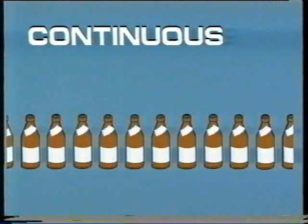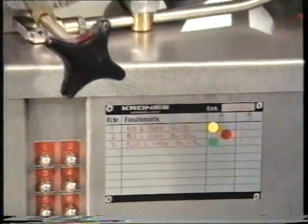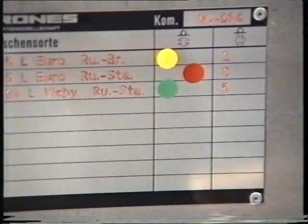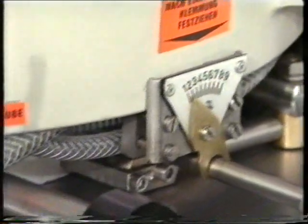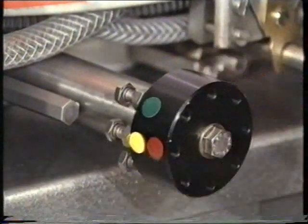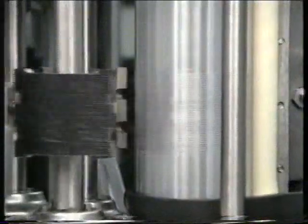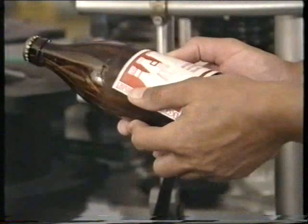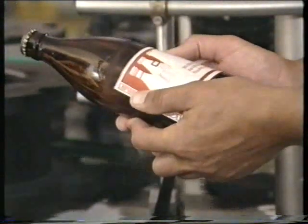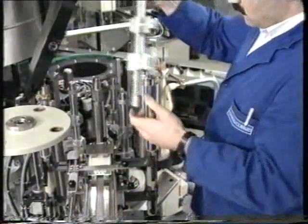Now to continuously slanted or shifted labels. The position of the aggregate with respect to the bottle plays an important role. Therefore, for each bottle, the cross slide must be positioned at the corresponding marking on the machine. Frequently, an error source for slanted labels is too much glue — the labels can then be shifted in the brushing-on station. Easy to check at the discharge: the label must not float, as shown here.